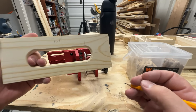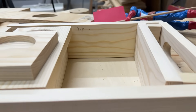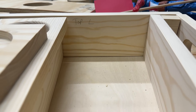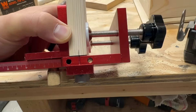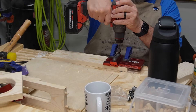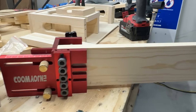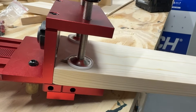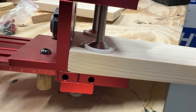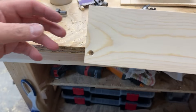I'm marking all the inside of my pieces so I don't mix them around when I start doweling them. The dowel jig actually worked pretty awesome — all the pieces lined up well, it was awesome that I could clamp it, and it seemed built very precisely. But it could not stop user error. I was going pretty good, got a little cocky, got all my holes drilled — and then I forgot to adjust my stop collar when I switched to the other side and drilled all the way through my sideboard. I also drilled through part of the plastic on the jig.